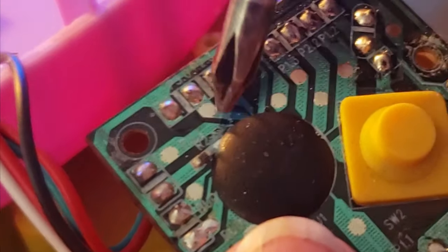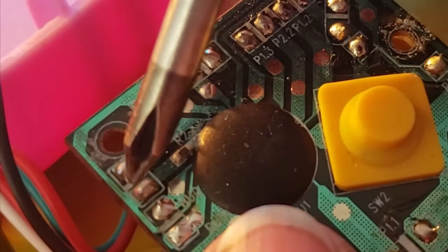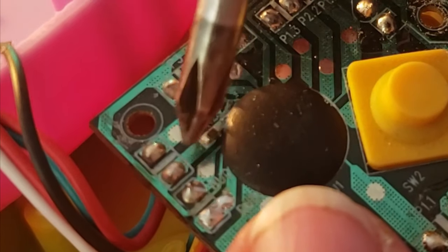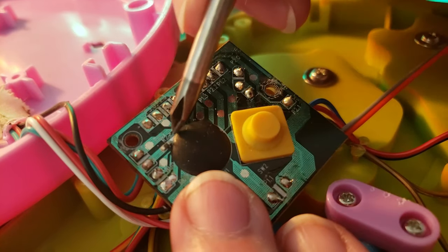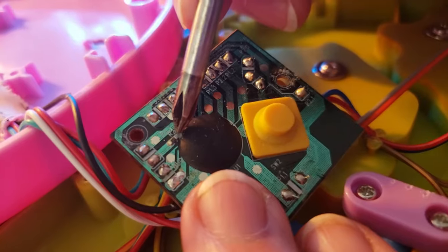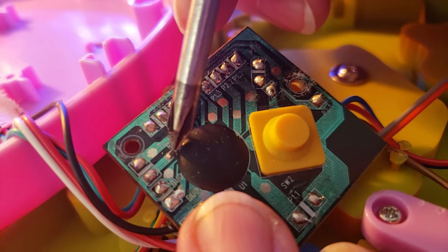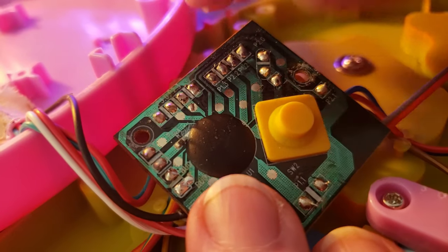Now, this is going to be really easy on this side because, as you see, this is on the same track, so we can just as easily solder onto this. So our solder points are going to be right here, and right here. So we're just going to go with those two. But these are micro integrated circuits, micro resistors. So very often what happens is if you solder onto this side and you solder onto this side, this resistor is going to come off the board.